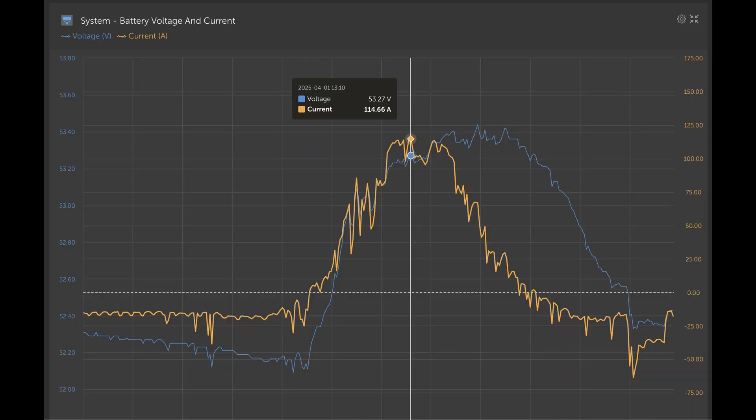Good afternoon everybody. It was a really beautiful day today. For at least a couple hours it seems like I was pulling in almost 100 amps continuous from solar, which when your batteries are really low because the weather has been really crummy recently, just kind of brings a smile to your face. I want to show you how we have the panels organized into different arrays on the coop, bring it down into a combiner box, and ultimately how we get the power from that combiner box to the different charge controllers so that we can use it.